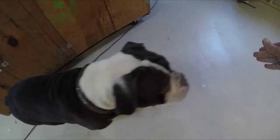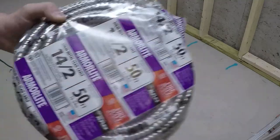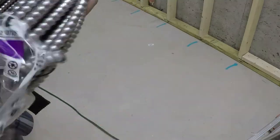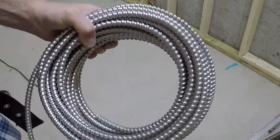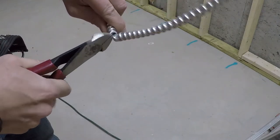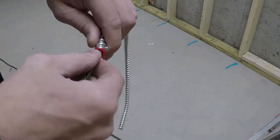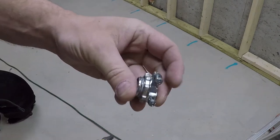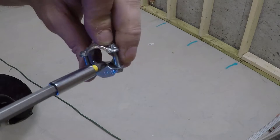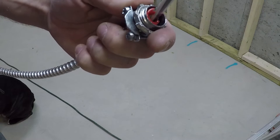As always, make sure you find time to mess with your dog, cat, or hamster — whatever floats your boat. Now to get serious: the clad wire can be a little bit tricky — bend, break, cut, strip. The most important part is making sure you're installing that anti-short bushing so the sharp edges don't cut your wire and cause a short. Then take your 3/8 clamp connector, put the wire with the bushing through it, and tighten the two screws on the sides to clamp it down.